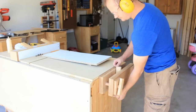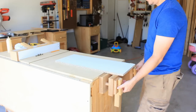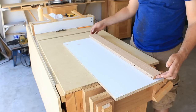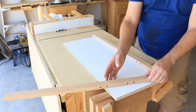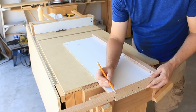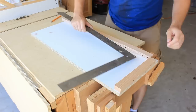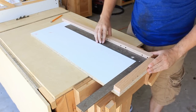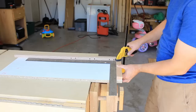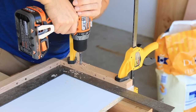The jig will be clamped in my bench vise. To keep the vise from racking I'm going to place this spacer in first. Now those two pieces — I've kept them together. One will go on the long side and the other flipped 90 degrees. I'll mark the length of the second piece then cut that at the miter saw. The two pieces need to be exactly corner to corner with each other or this will be off. I want to be able to remove these pieces, especially the top one as you'll see later, so I'll attach them with dowels.